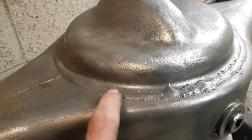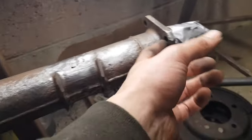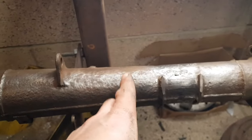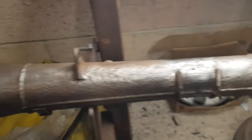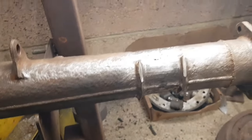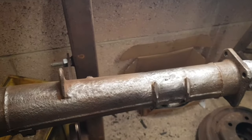I'm hoping this isn't cast iron — I don't think it is, I think I'd know if it was cast. I'm going to warm it up first to get all the steel nice and warm so as not to stress-crack it, just in case, and then slowly build up and grind back, build up and grind back until it's at the same height. I'll probably go around and give a few bits of weld on anything else I find. I'm going to crack on with warming this up and beginning to MIG weld it.